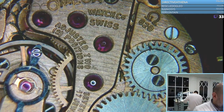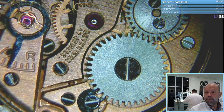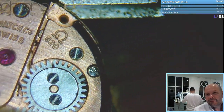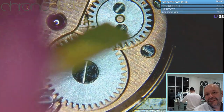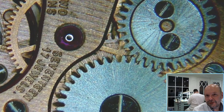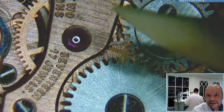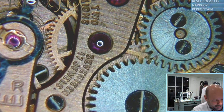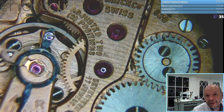Now first I'd like to make sure the power on the barrel is released. Oh wow - I'm just pushing slightly with my finger on the crown, and there is a huge amount of play there. More importantly, if you look right in between there - I'm just slightly turning the crown - you can see it's tilting towards this center wheel over here. You see this bit here tilting upwards against the center wheel. That is the reason why this watch wasn't running so well, along with the lack of lubrication and maintenance.